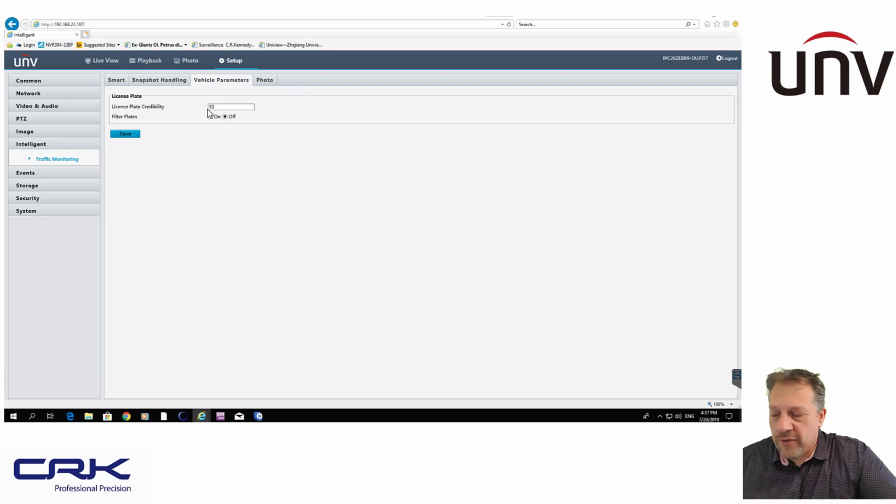There are some settings. I have actually got a handout sheet which I cover when we run courses at CR Kennedy. So you can get a copy of that where I talk in more detail about the license plate credibility. But basically, the more credible the plate, the more likely it is to be recorded as an event. So if you find that you're getting lots of inaccurate results, you might need to increase that license plate credibility so that it's not just reading lesser qualified text.